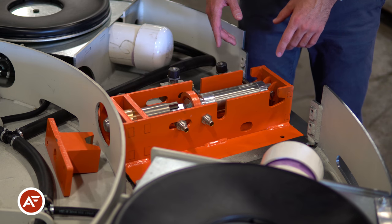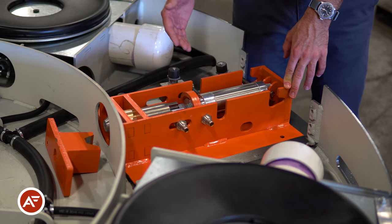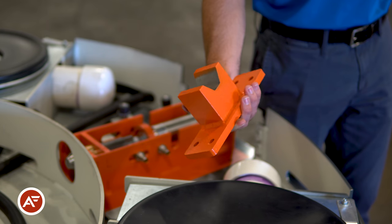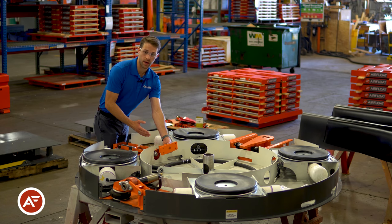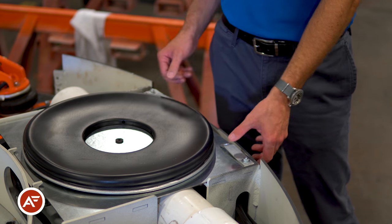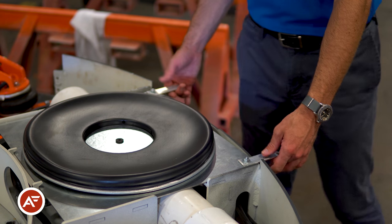Let's take a look at the pneumatic shot pin. The pneumatic shot pin allows you to precisely locate your tabletop. In this case, the shot pin upon reaching the 180 degree position would shoot out into this v-block which precisely locates that tabletop plus or minus 1/16th of an inch. It's important to note that all of these internal components can be removed or replaced without having to take the load off the top of the table or removing the tabletop.